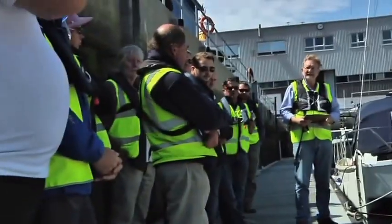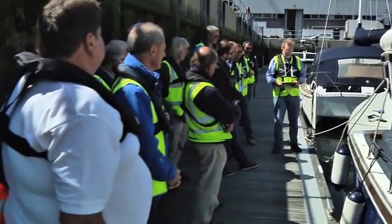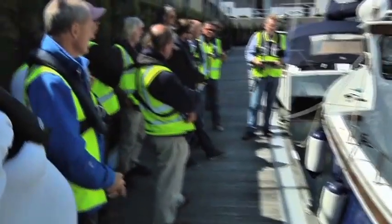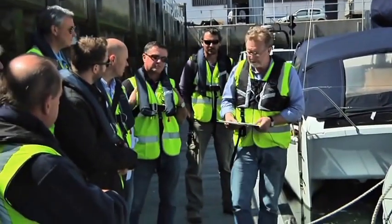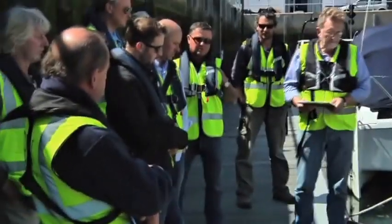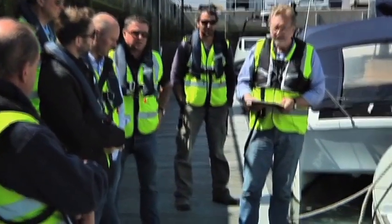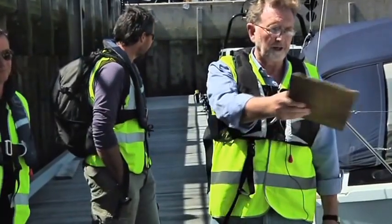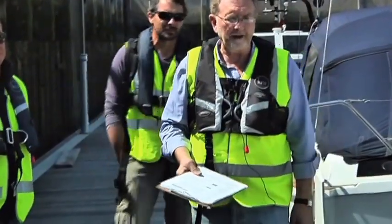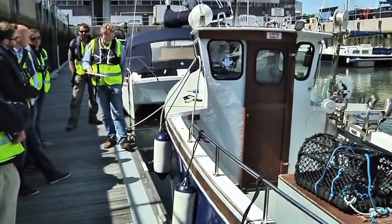Has the scuppers got to be a certain size and amount? Size of the deck? Yes, they do, and that is based on the area of bulwark. 4%. And off the top of my head, yes, it's 4% of the area of bulwark. Except that on a boat under 12 metres, if it's not practical to have that number of slots in the side, you can have two ports in the transom at the back, which need to be 250 square centimetres, I think, yeah. In the book.